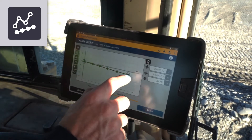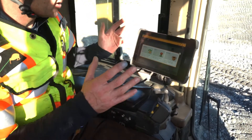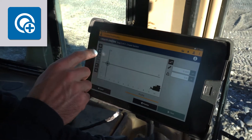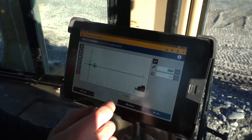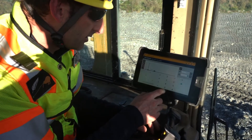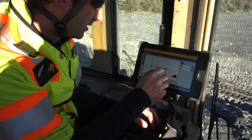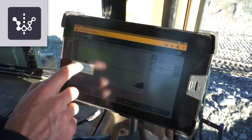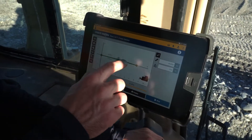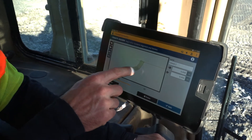I've got that nice constant mainfall down my ramp. I can hit next to build my profile for the cross section - that's going to be the width and the shape. The first thing we do is add a point for our section or profile, then we can edit the width. Running up and down the ramp we need 4 metres either side of the centre line, and we'll put a crown on it - a little bit of slope to shed the water at 3%, so you can see that's just lifted it up in the middle there.